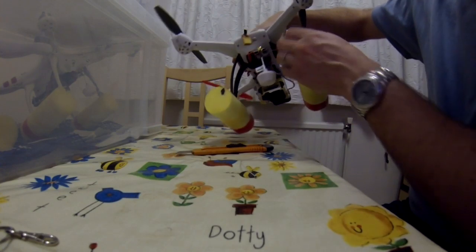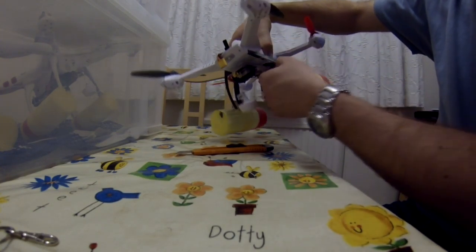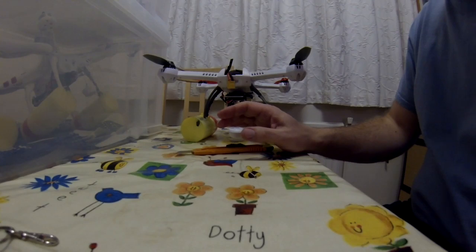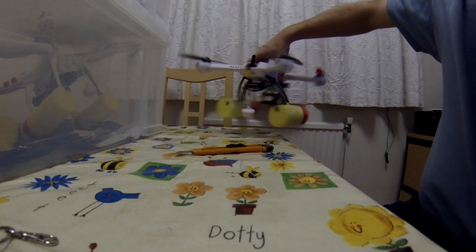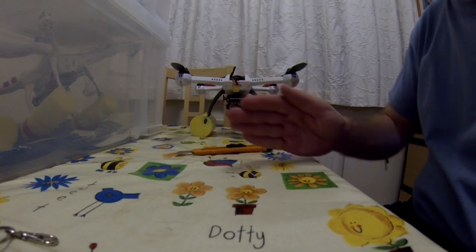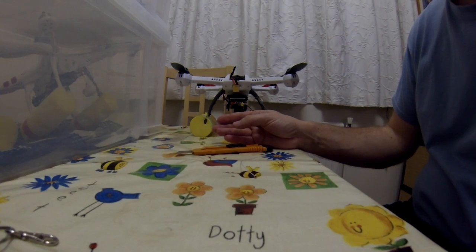After the mod, the extended aerial now comes out through the bottom of the body and I've got it taped to the skid. I re-did the range test and got 22 paces nose in — which is the worst orientation — and 30 paces tail in, so I doubled the range test range. I don't know if that will equate to doubling the real range, but I'm pretty happy it's going to be a significant improvement. I'll test it when I get some better weather and put a comment up.